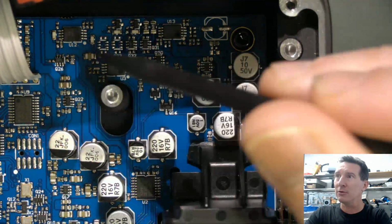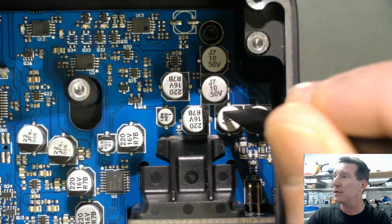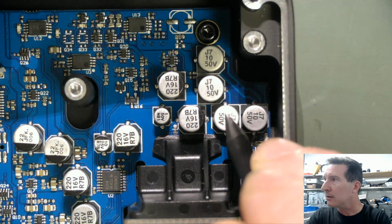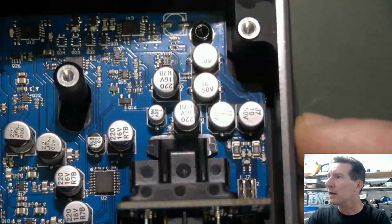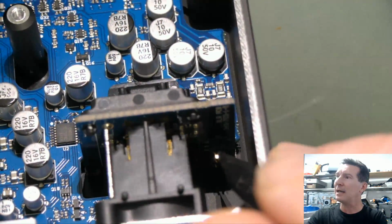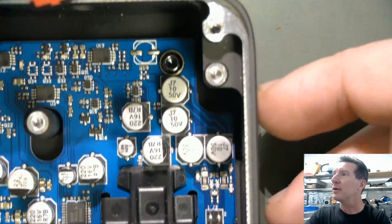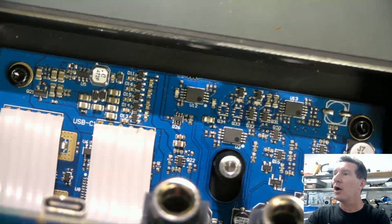I now know what's going on here because I just did it before. So this is our phantom power. You can tell our 2 high volt, our 50 volt caps here. Okay, they're running quite close to the nominal 48. Are they in parallel? No, they're not in parallel. So they look like, oh, okay, yep. So they go up to here. So that's transferring the phantom power over by the looks of it. Are they doing just some protection resistors there? No worries. Anyway, so this is our phantom power, but our phantom power is actually generated over here.